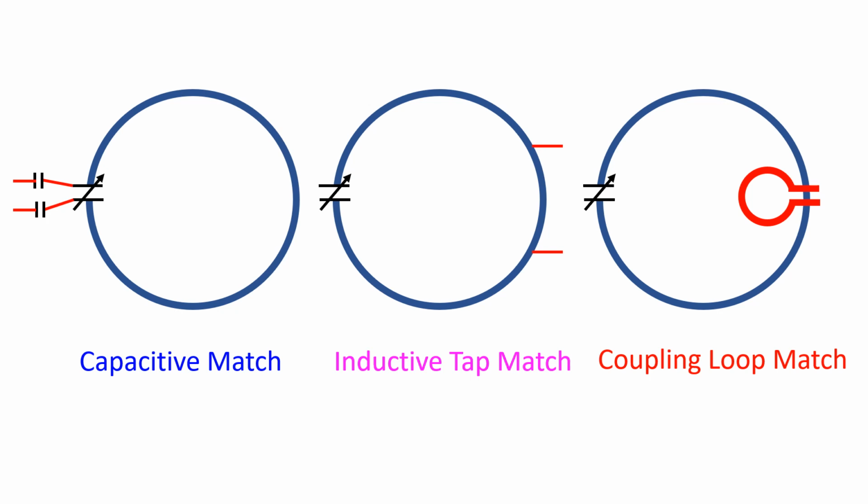Small loop antennas are less sensitive to picking up electrical noise in the near field, typically less than 1 wavelength. This might be a boon if you have nearby electrical equipment which generate electrical noise, which is quite common in modern living spaces. This could be the reason why they are called magnetic loop antennas. A small magnetic loop antenna responds mostly to the magnetic component of the electromagnetic wave and is fairly insensitive to the electrical field component. So they are able to receive weak signals out of the ambient noise.